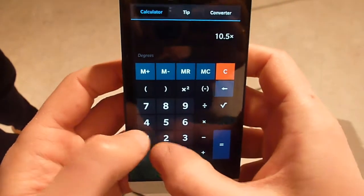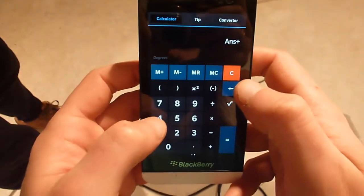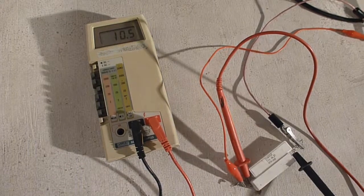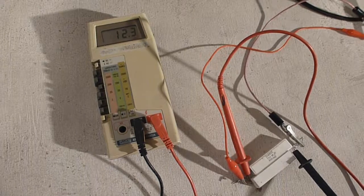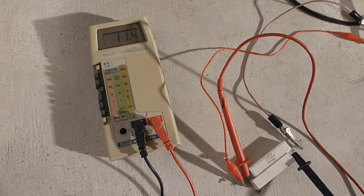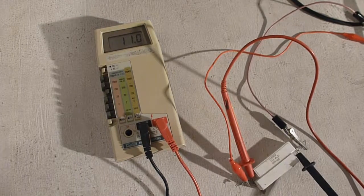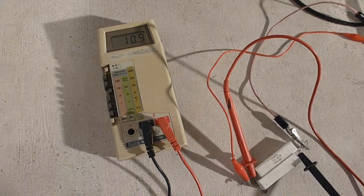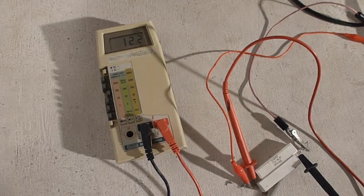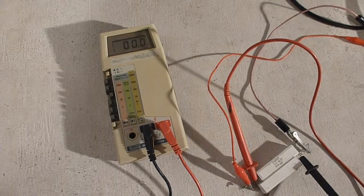For this amp, 10.5 times 10.5 — that's voltage squared — divided by the impedance of 4, gives us 27.56 watts. If you turn the volume all the way up, it goes to 12.3 volts, which is equivalent to 37.8 watts. But it's not actually putting out that much, because this multimeter — like most on a reasonable budget — is not true RMS, so it's not accurately measuring the current once the signal is heavily distorted. Before clipping, these multimeters are pretty accurate at determining voltage, but once you have a very distorted signal, they're not. The honest truth is this amp is probably putting out slightly more than the 27-and-change watts shown.